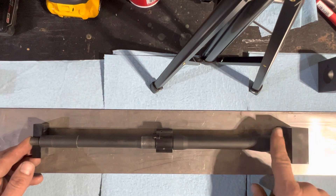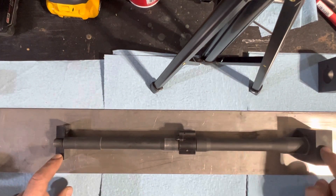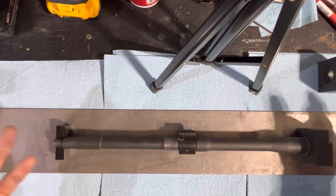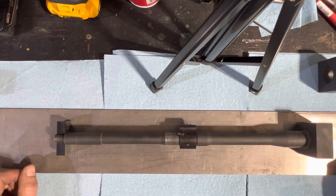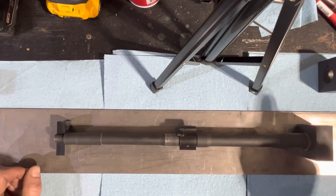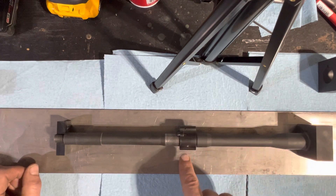It's timed at 90 degrees from the spindle. If you've got a block with a pilot hole or pilot flat, you can use this muzzle block and rear block on a piece of flat bar — or set it directly on your mill or drill press table if it's big enough. Clamp it down, and with that flat you can drill away with a number 31 drill and go to town. If you're already comfortable indexing without these blocks, go ahead, but this setup makes it simple.